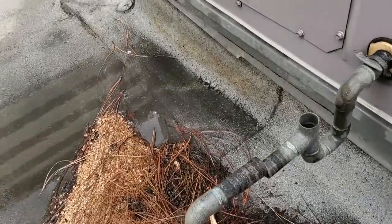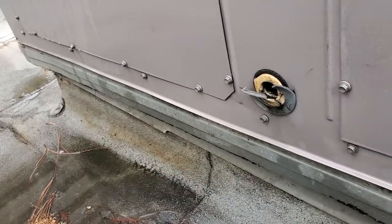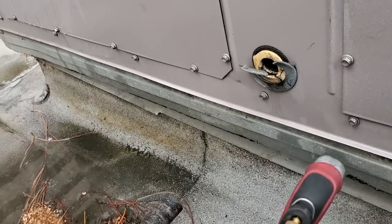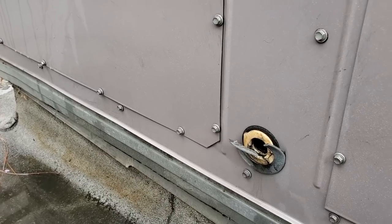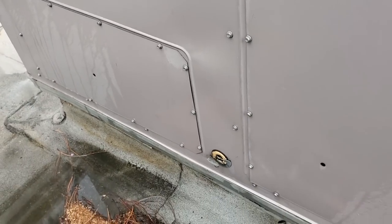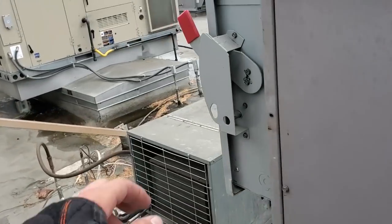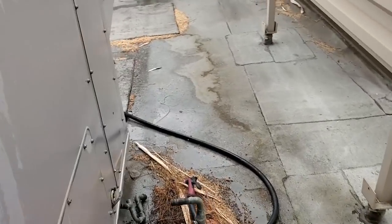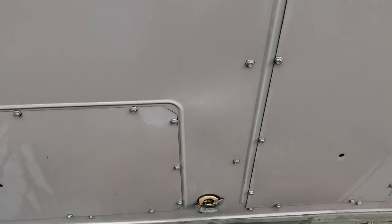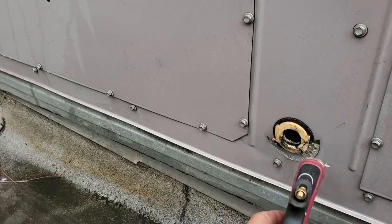When it comes to this drain, remember — you can't expect it to drain because this has a negative air pressure drain pan. You can't really expect it to drain when the unit is running. What you'll notice is when you shut off the unit, you'll see water come out. I'll go ahead and shut it down because I'm going to check the evaporator out anyway. Looks like just barely, not much, but if it was plugged up or had a lot of condensation it definitely would.